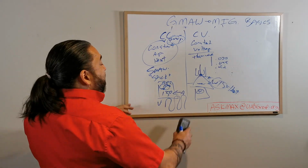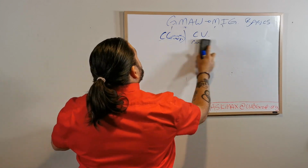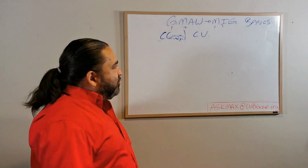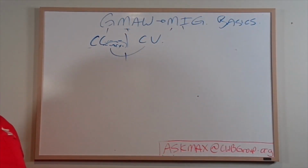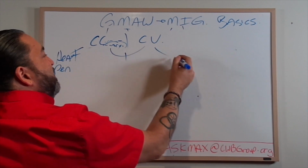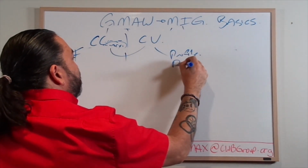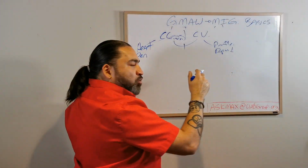Okay? What's happening now? Well, what's happening now is that because of our awesome inverter, SCR, IGBT technology, we have a sort of combination of these things. We know CC is awesome for heat and penetration. We know that CV is awesome for profiles and deposition. This is slow and hot, but gets deep. This is fast and pretty, right?